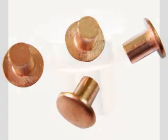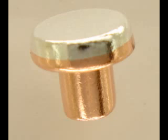Gold contacts exhibit the best corrosion resistance but are limited in current capability and may cold weld if brought together with high mechanical force. Whatever the choice of metal, the switch contacts are guided by a mechanism ensuring square and even contact for maximum reliability and minimum resistance.